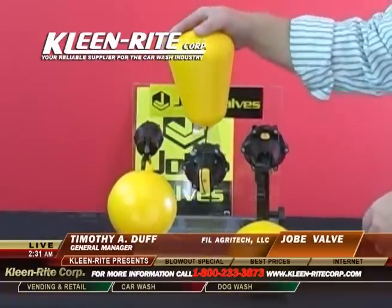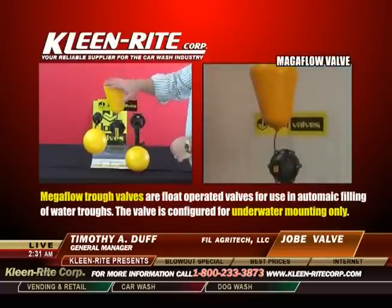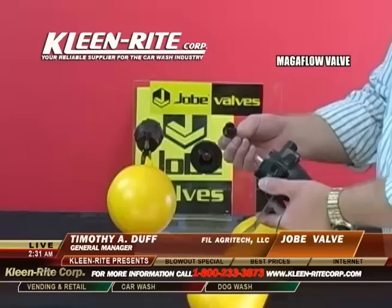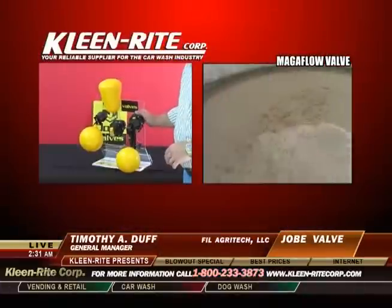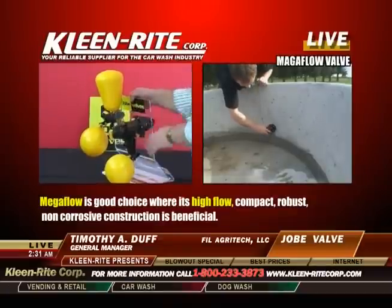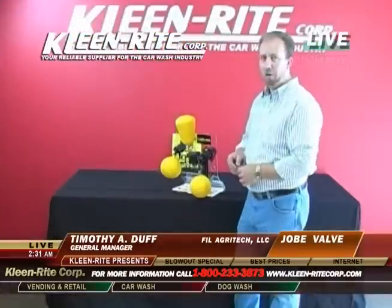The next valve is called the Mega Flow valve. Much like the Topaz, it is high flow and is for underwater mounting only. The water comes up and pulls on the float, which pulls on a string and triggers the valve on or off. It has Jobe's patented detach feature so you can take the valve off, clean out the filter, and even with the water running full flow you can put the valve back on without shutting off the water supply. The Mega Flow valve also has a lock off feature — the string hooks behind a notch on the valve, pulling the mechanism into the off position for temporary shutoff without removing the valve.